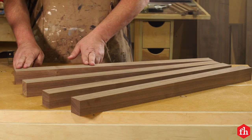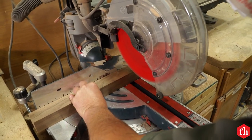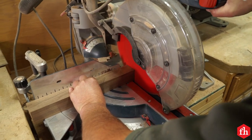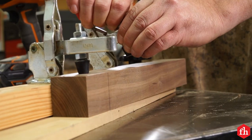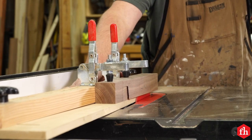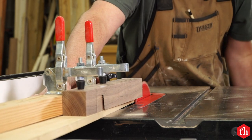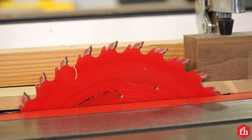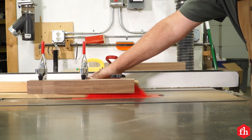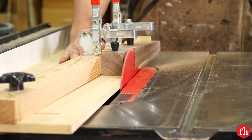I've got my leg blanks cut and these legs are two sections. There's an upper portion that supports the top, which stays square, and then the lower part we're going to taper in two directions. I'll cut off the top part first, then take the lower section to the table saw to cut those tapers. Using a shop-made tapering jig, cut the first taper on each leg — I made this cut in two passes. Next, set the jig for the second taper and cut that taper on all the legs.